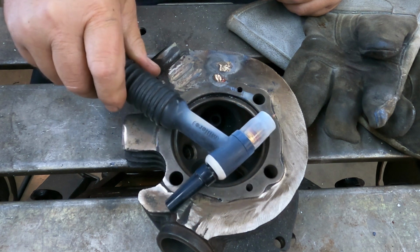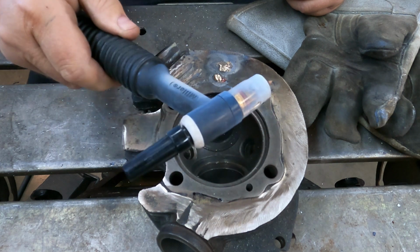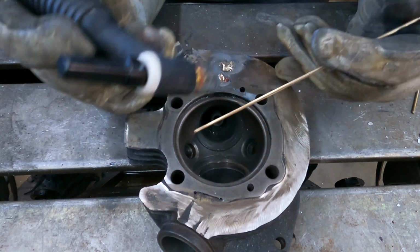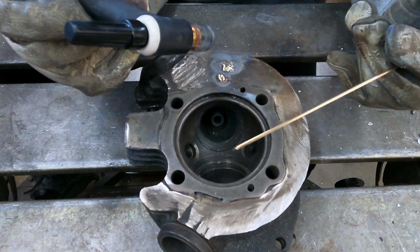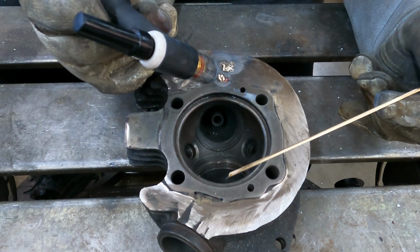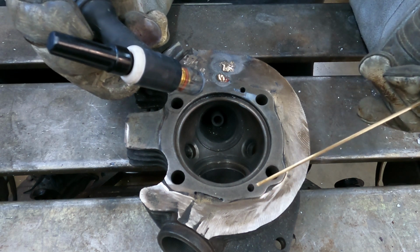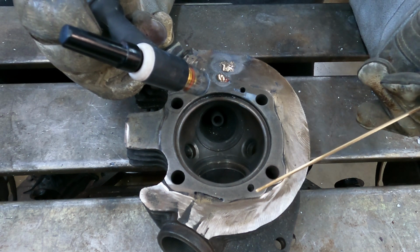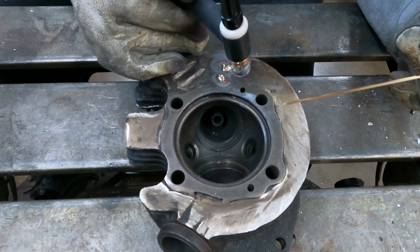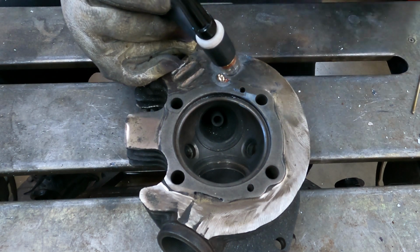Just a little look at what's happening to my torch from all of that. So we'll get this cleaned up. We're going to try it on AC. Alright, I got another piece of generic hardware store brazing rod. Torch is all cleaned up again. I've got the welder set to AC, the same 80 or 85 amps, whatever it was. I've got the frequency down to 70 because I think I want to cast kind of a wide heat zone. And let's see what happens with this one.